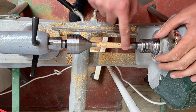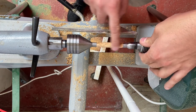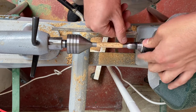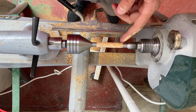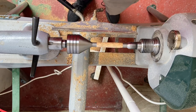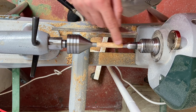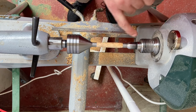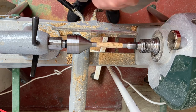So I'm quite happy with that. I now need to move on to giving it a quick sand, starting at about 320 grit, moving up to about 600 grit. What I will do is take these bushes out of the blank now and just put the blank directly between centres. This will avoid any accidental abrasion of the bushes, which sometimes with the lighter blanks will leave you with a discoloured end. So by taking it off the bushes and doing it between centres, you'll avoid some of that risk.